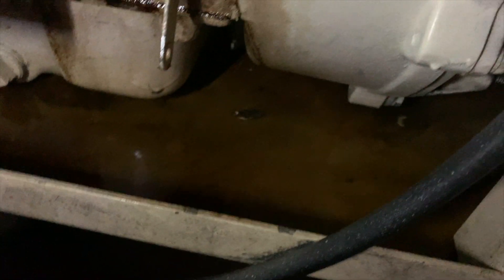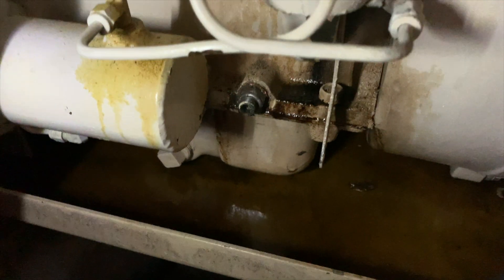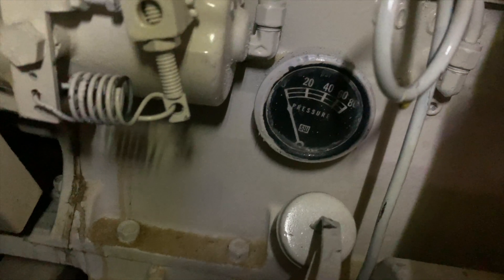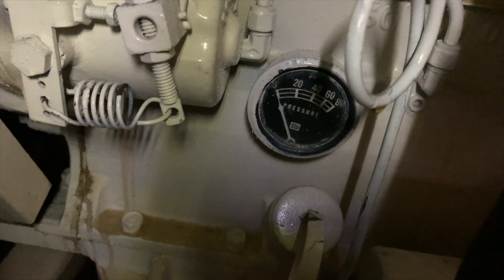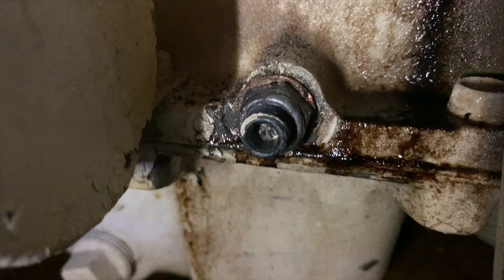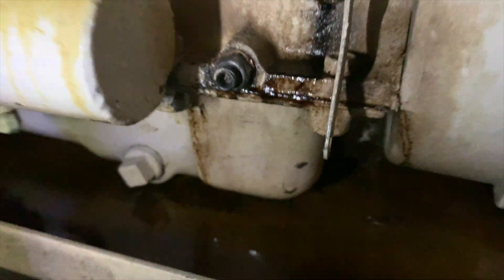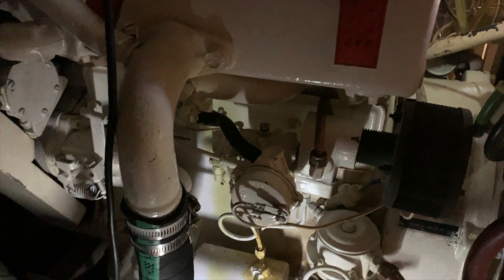It definitely uses quite a bit of oil. Down there there's something — I don't know what that is — it's like oil and coolant mixed. It's just not a very happy generator right now. We also have an issue where when it's running, this pressure gauge is showing only about 15 PSI. It's supposed to be at 20. There's a little adjustment screw right here that I did adjust to try to give a little more oil pressure, but it didn't seem to help very much. So this generator is going to need some love, but right now we just need it to get us through while we don't have any power.